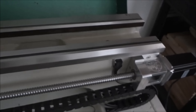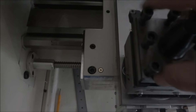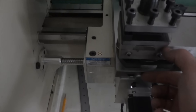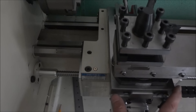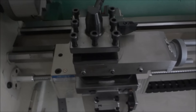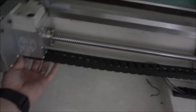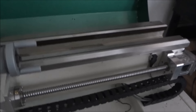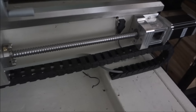The mounting is definitely very secure and it's away from a lot of the splash, so I'm hoping this is a good spot for it. The Z switch should be safe way back there. I've got a couple of tools in the four-way tool post, and I'll maybe generate some G-code and run a part with this four-way tool post. I've got a block I need — a 2-inch high, almost 5-inch wide block of steel — for my spacer for the quick-change tool post. When that gets in I'll be working on that. We've still got to get our coolant done. As you can see the cable tray works really nicely — I'm really happy with that; it's going to keep the cables out of the way and prevent binding.